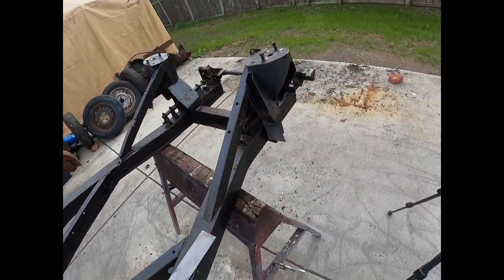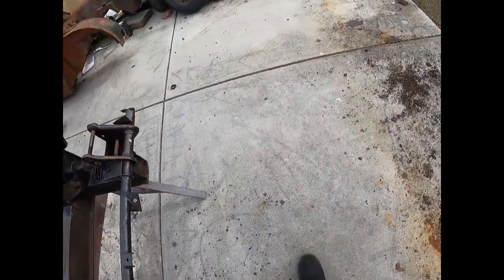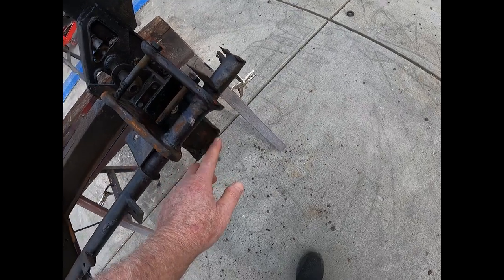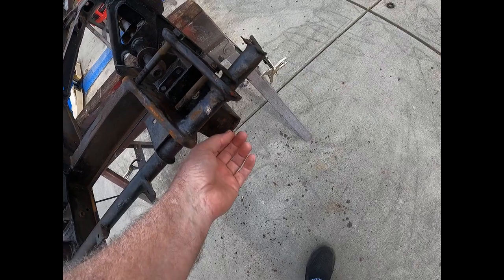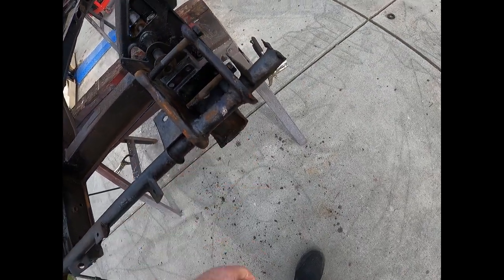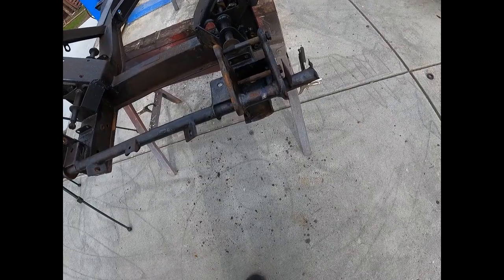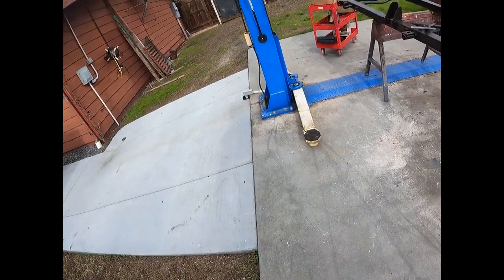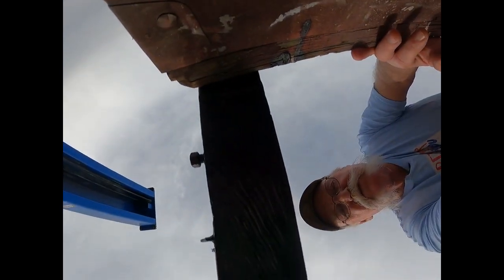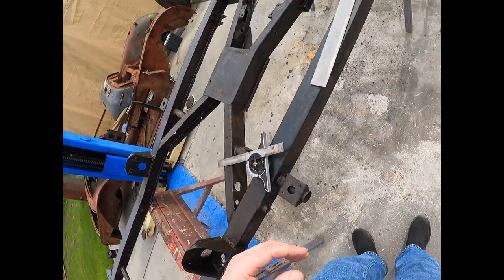I've been doing some other little bits and pieces. I did a little bit of welding on the nose right here — this edge had hit a curb or something and was kind of folded back, so I straightened it out and just welded a little bit to get the divots full. I also did a patch on the back right there. There was a dent in the frame, so I cut it out with a hole saw, flattened it out and welded it back in.